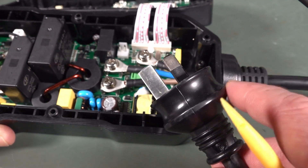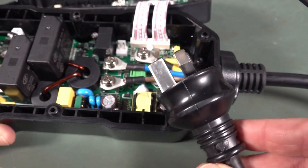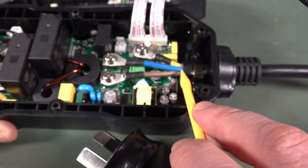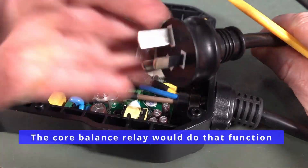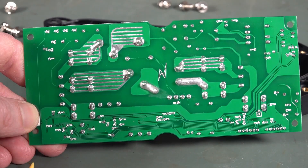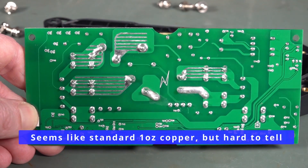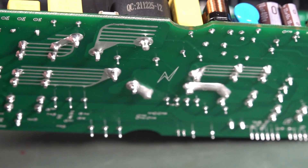You get dodgy connections on your mains input plug and that can overheat and ruin your day. So you would want to add a thermistor in there — they would use a non-standard mains cable with an extra pair going up to the thermistor, and that would just plug in there. There doesn't seem to be another input for any moisture ingress sensor, because this is a portable one and you might use it out in the rain. Back side of the board — only single-sided load — and they've got some extra current-carrying capacity by removing the solder mask and just leaving the solder plate on there. Nice spacing, everything's hunky-dory, nice solder joints, it's all looking pretty schmick.